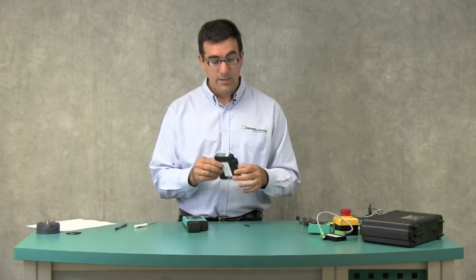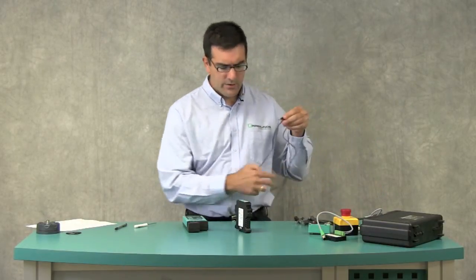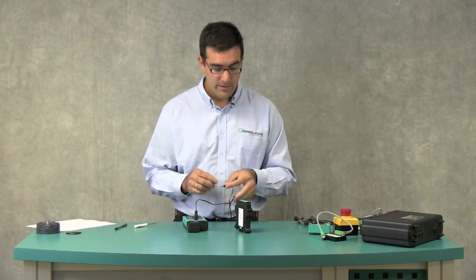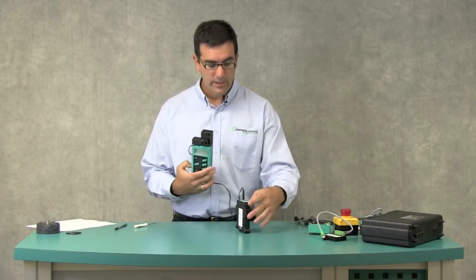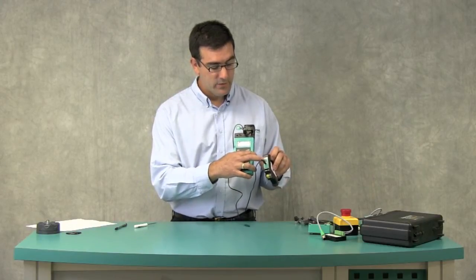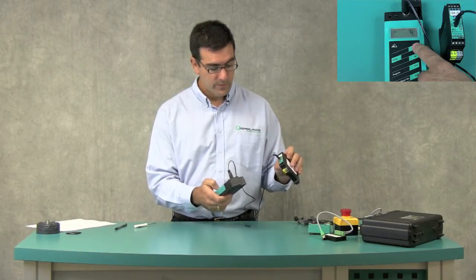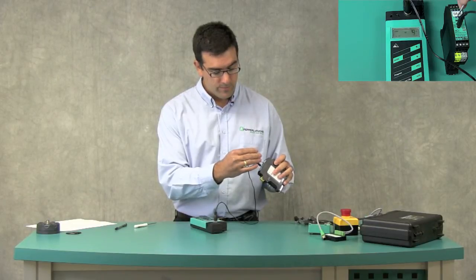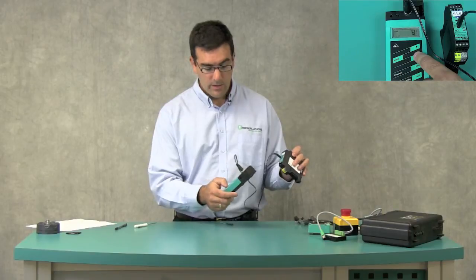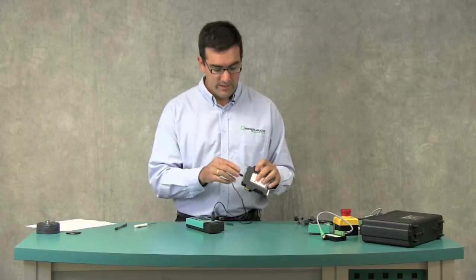With the 3.0 handheld, we also made some changes to the programming of the safe output module. This has an addressing jack too. The old handheld just didn't keep the power on long enough to properly program it, so with the new one we just keep it on a little bit longer. I've pre-labeled it — I want 9A for the standard address and 8 for the safe one. I'll arrow down to number 9. Number 9A will be in run mode, then you flip the DIP switch to program mode, go back to 8 and program it. With the old handheld, you had to hit the address key repeatedly to read the address and hit the program key repeatedly to write it — it was a little frustrating.